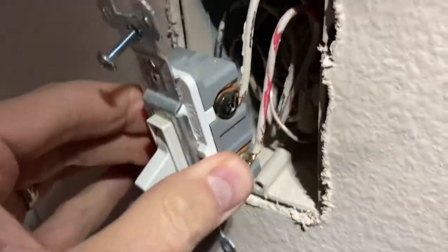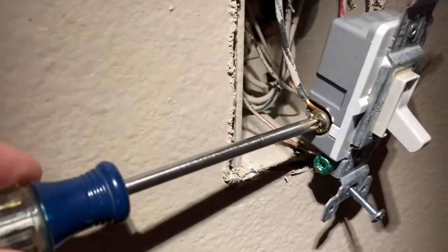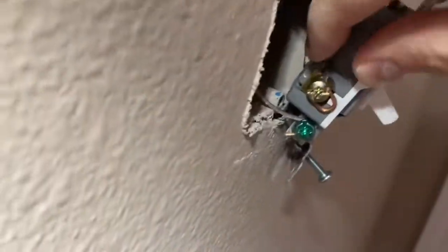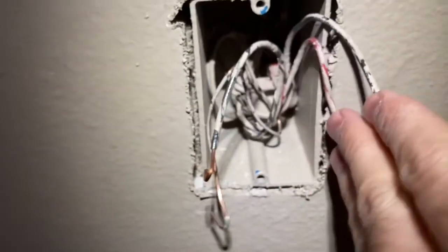We're going to remove both switches and again make sure wires are not loose. I've deduced we're going to have to change this one out and replace it with a new one. To do so, unscrew the set screws for the wires. You can use a colored marker on the insulation part of the wire and then put a matching dot on the light switch itself. I'm going to keep those wires respective to their left and right sides — two to the left and two to the right — as my memorization strategy.